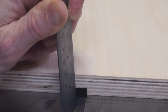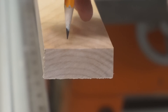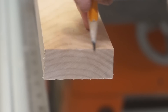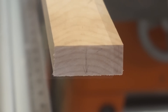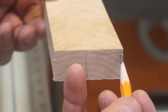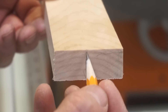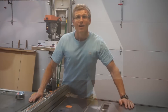It looks like it's about 5⁄8 from the bottom, so I'll come up ⅛ of an inch. Based on what we know about wood, it'll expand more tangentially across the grain than it will radially in this direction. What that means is we want the ½ inch thickness to be oriented in that direction, because it's going to expand more than in the other direction. This dimension will be exactly the same as the thickness of the miter slot.